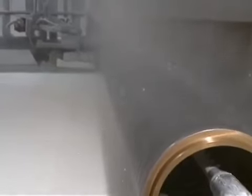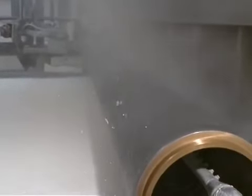Still here on the wet end of PM4, the paper running by is going at about 650 feet per minute. You can also see that here on the wet end, a dandy roll is putting a watermark right onto the paper.